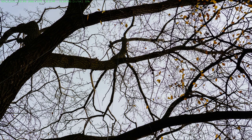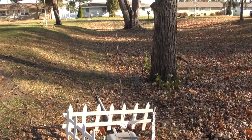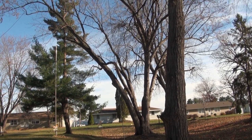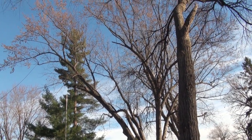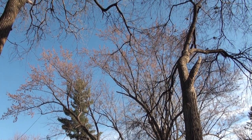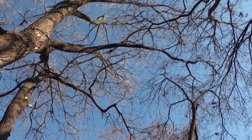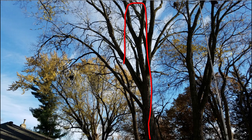In this image you can see the amount of twigs and branches I'm dealing with. The only way to get the horizontal section of this antenna horizontal is with a crane. So I present to you the NE0U 160 meter EZJ — an inverted J antenna for 160 meters. No, not a J pole for 6 meters. An inverted J for 160 meters, top band. From a technical viewpoint, this antenna would be considered a folded monopole, which is similar to the DX Commander line of antennas offered by Calum M0MCX. People seem happy with those, so I figured I'd give this a shot.